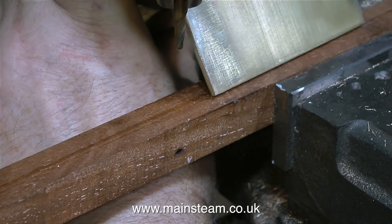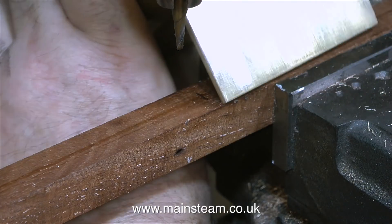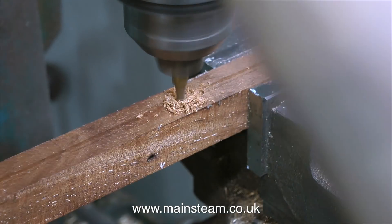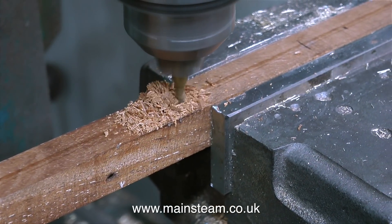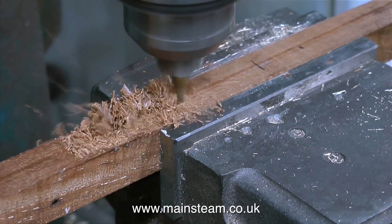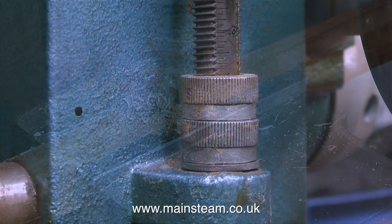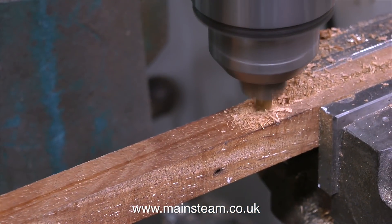So now I need to make a simple mounting to mount this part into the bottom of the boat. I'm going to machine slots in two pieces of mahogany — this is really good quality wood, and it's currently in the machine vice on the milling machine. I'm using a milling cutter called a slot drill to cut the slots in the wood. Because wood is much softer than metal, I can actually cut this full depth in one go. Although the first cut is not full depth — I took a test cut first to make sure it was going to work. The slots need to be deeper, so once I made this test cut on the mahogany between the two marked points, I cleaned off the wood chippings with a paintbrush, and then I increased the depth by turning the handle and lowering the cutter down into the work. Once I adjusted the depth of cut to the right level, I adjusted the depth stop so that when I cut the other slot it would be exactly the same as this one.